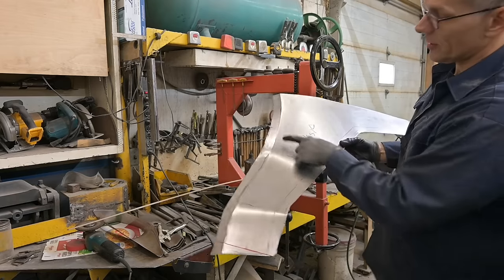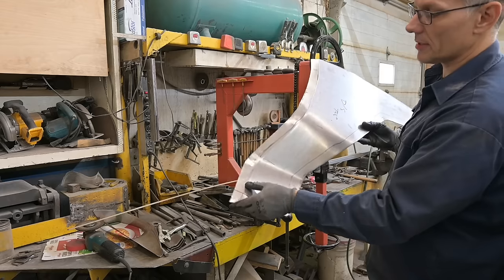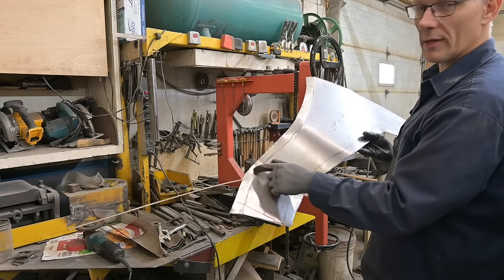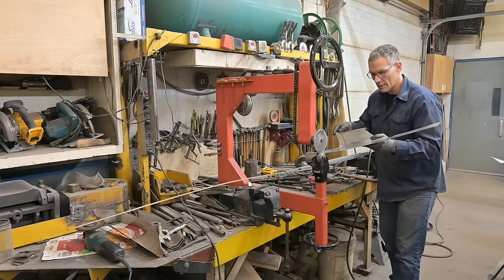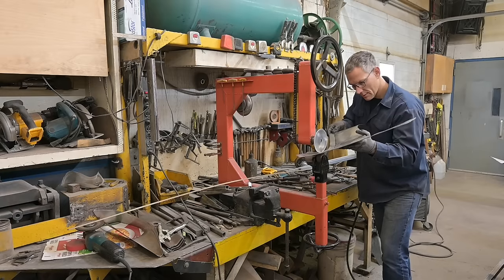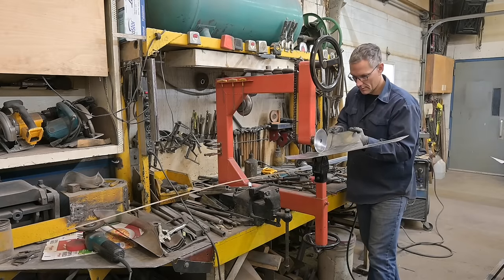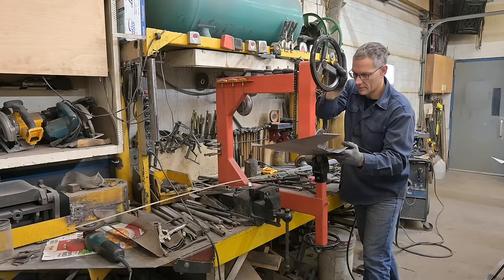All right, so I just finished shrinking this corner, stretching this one, and you might see some prominent jaw marks. I'll show you how to clean that up in the next video. What we're doing today is tipping this flange. It's gonna be quite a bit of work when it comes to these parts.